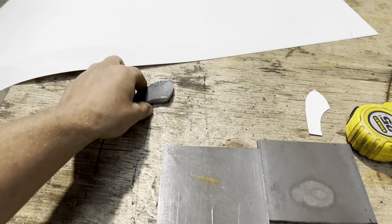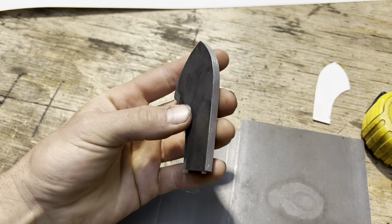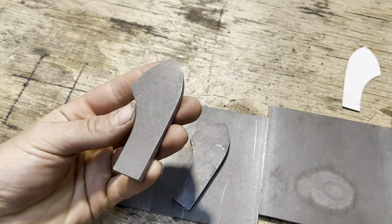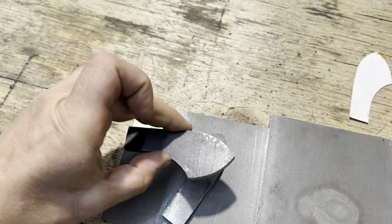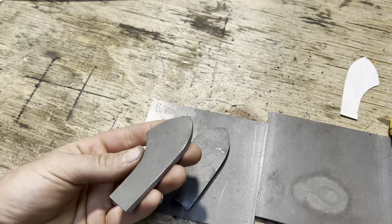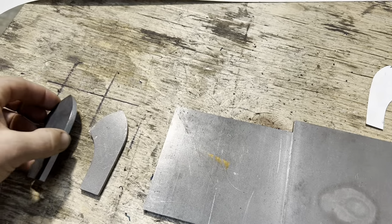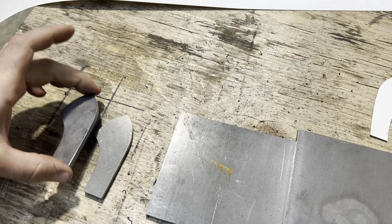All right, so I've matched up these two guys. You can kind of imagine what these will be for. These are our dies. So we're gonna have to shape these to be the shape that we want depressed into the backside of our sheet metal. So we're gonna use 18 gauge for the hammer form. The reason I made two is because we need a left and a right. And we're gonna be welding a bar on here so that we can hit it with a hammer to depress